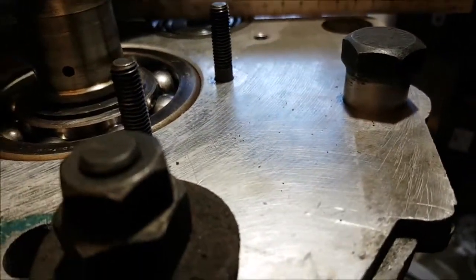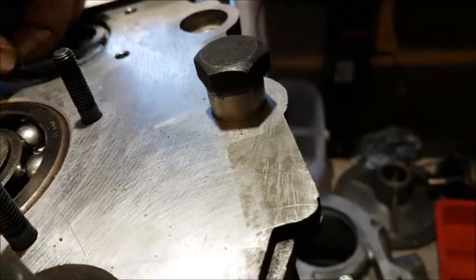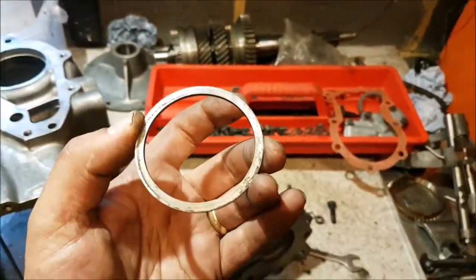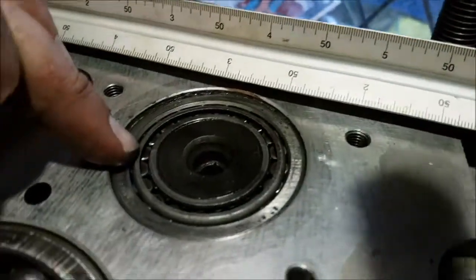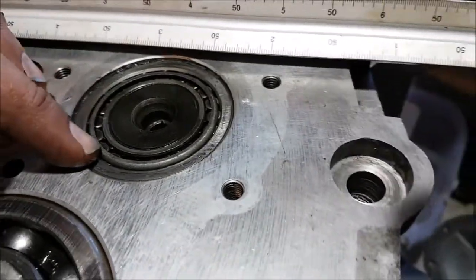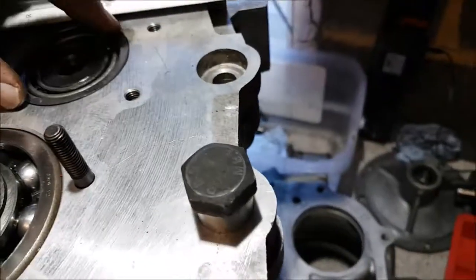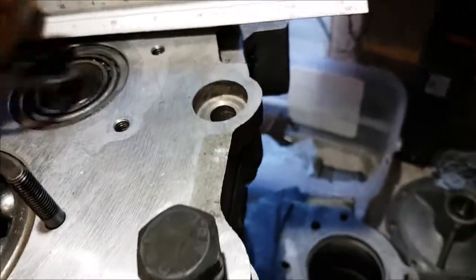However, what we're finding is that we've got nowhere near the right measurement. So what I'll do is measure the thickness of this using a micrometer, then see what shims are available and go for some fatter shims to increase the resistance. Now what I'm going to need to do is bang that bearing in slightly — it's like a wheel bearing because it's got a coned edge on it. So I need to move that end a little bit, put the fatter shim on it and then test again.